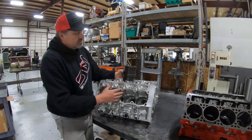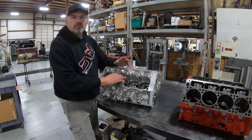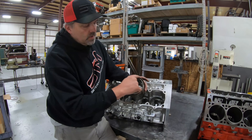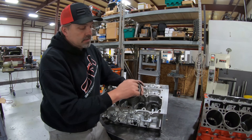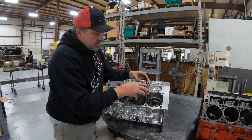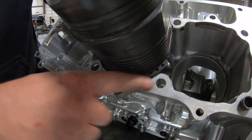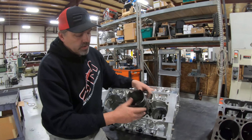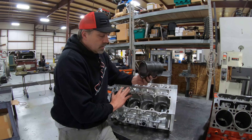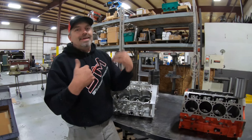I'm not a big fan of this design. If it's making around 1,500 to 1,700 horsepower it's probably not a big deal - it's a nicely wet-jacketed block. For my replacement sleeves I've made them solid, so there's no longer water coming up through the deck surface at all. There are a few passages there too that we're going to block off, run it with a better dry deck setup - so if it ever does blow a gasket it at least doesn't spray water everywhere.